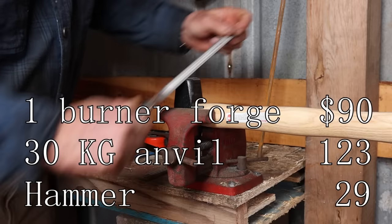When I ordered from Blacksmith Supply, I bought one other thing. It's a 12-inch piece of half-inch diameter S7 tool steel. S7 is a good steel for making punches and chisels. We'll at least need to make a punch, and we'll look at that in an upcoming video. But this is a pretty good option. It is tough to forge, but it is also air hardening, so you don't need to worry about a lot of complicated hardening and tempering procedures. So I think this isn't a bad way to go. We're going to try it out and see what we get out of it.